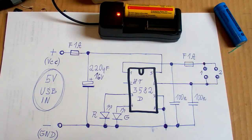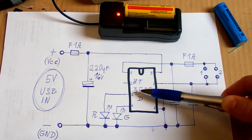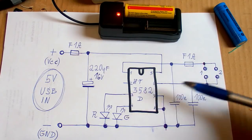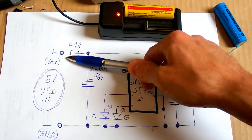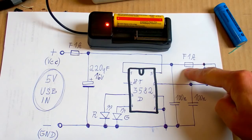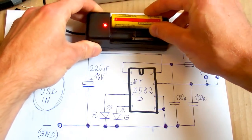In the end it looks about like this. I recommend you to put a fuse here and also here, because if the chip goes short internally, it won't short your battery, and it will also protect your power supply. Fuses also reduce the risk of fire because lithium-ion batteries can catch fire or explode at any time.